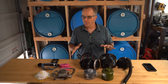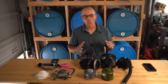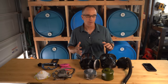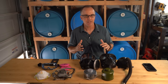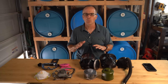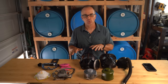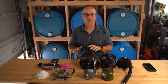During this video one of the measurements you'll often hear is microns. A micron is a unit of length that's one millionth of a meter — here in America a meter is 3.2 feet. To give you context on size, the width of a hair is around 70 microns, and smoke particles are typically around 0.1 to 1 micron. The filters we'll discuss are rated to filter down to 0.1 micron, so they'll be able to cover smoke particles.